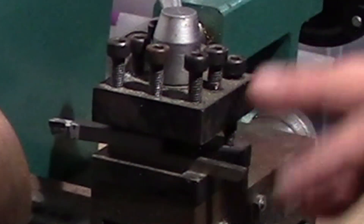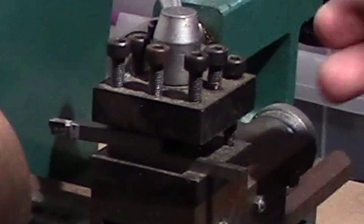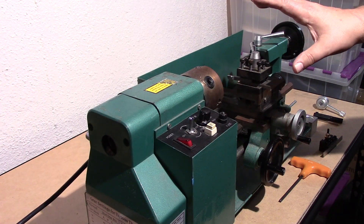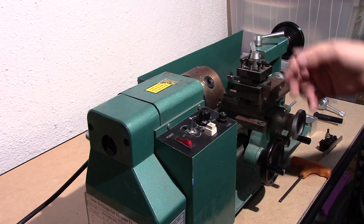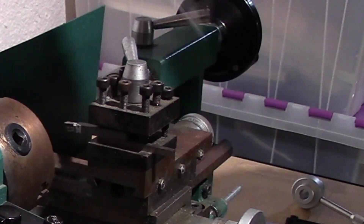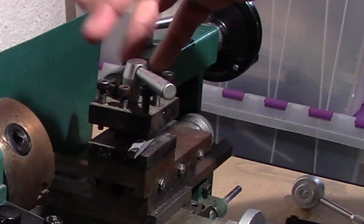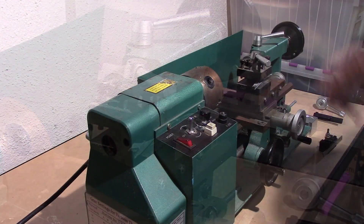One of the things I want to show you before I got started — here's kind of one of the reasons I wanted to do this, sort of a dirty little secret. As I mentioned before, I used these cut-offs to kind of shim the tool bit up because with this holder it's just a fixed height. Basically how this holder works is you've got these three allen nuts and you use this wrench to adjust and tighten down on it. This piece will loosen up so you can have different tools and flip around. It's not really productive, so that's why we're changing it out for the quick change tool holder.